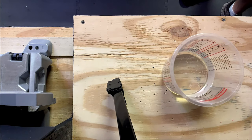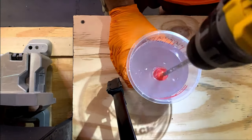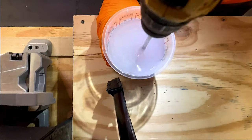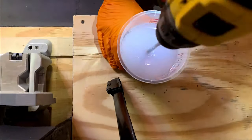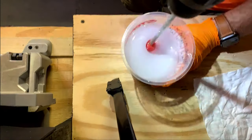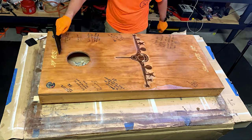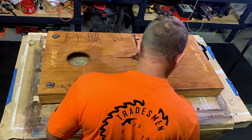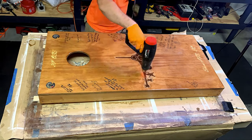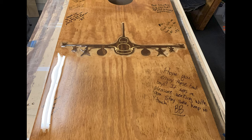For this, I'm using a one-to-one ratio epoxy. This one's actually got some UV protectant in it as well. It's basically a tabletop epoxy — I wanted a really nice hard finish and a clear look. I wanted it to preserve the names underneath as well as the coins, but I also didn't want it to yellow when being taken out into the sun, so the UV protectant really does help. They mix for about five minutes and this stuff is no joke and extremely tough to deal with. This is actually the fourth time I tried on two boards since I scrapped the first two projects. It came out a little more smooth than the last few attempts — I actually scrapped one completely down and sanded it all the way off and tried again. This result came out pretty well, minus a few flies that sabotaged it. I ended up sanding them out the next day, but it looks pretty good.